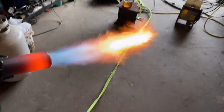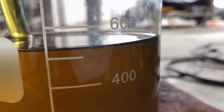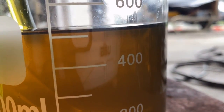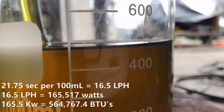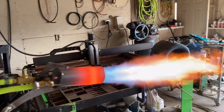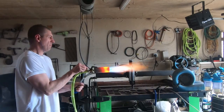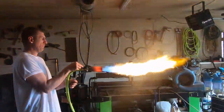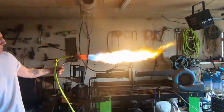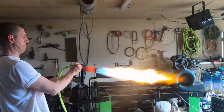This is a high-fire mode test. We are running the 3.5 millimeter orifice just to see how high we can get the flame without it going out, and we're going to see what the output is at that rate. So even with the 3.5 millimeter air annular orifice, we still outdid the performance of the propane torch. That propane torch cannot maintain that 500,000 BTUs when the bottle gets cold from boil off, so I'm kind of loving this.